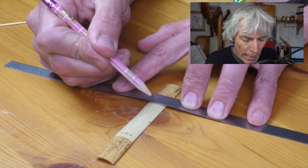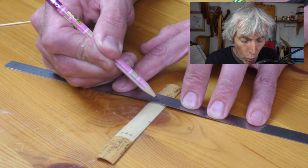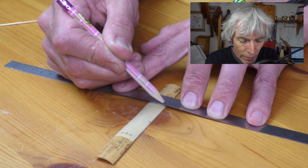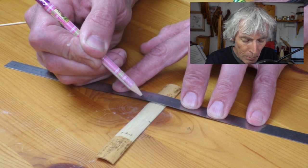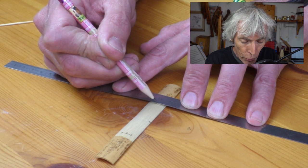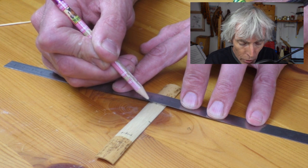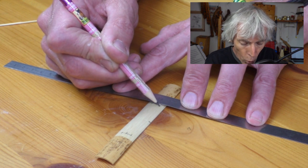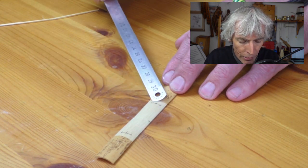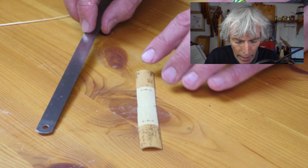And I'm finding a centimeter marking somewhere in the middle of the ruler. And I'm seeing how many millimeters overhang to the next centimeter mark there and to the next centimeter mark there. It's about 2, a little bit more than 2. And when it's the same on both sides, I can mark that middle point. And then I take 4 millimeters to the right, make a mark there, 4 millimeters to the left, and make a mark there. So I've got 3 markings on this line as well. And I've got these 2 in the middle and those 3 markings there.